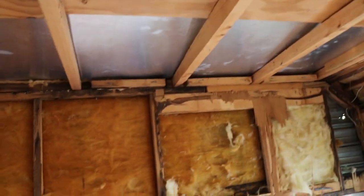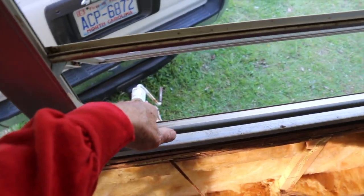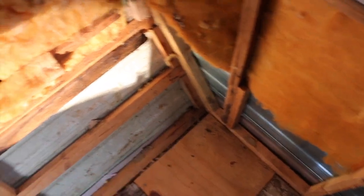And there you go. If you want to put in an AC unit, you can put it in place of one of these things. The other thing you can do is put a mini split out front where the gas tank sat would be the condensing unit, and then up here would be the blower. And you just run the line set through the wall, go out through the floor, and over to the condensing unit. Again, easy peasy. You can get one that'll run on 110. Okay. And this is it. This is what we have.